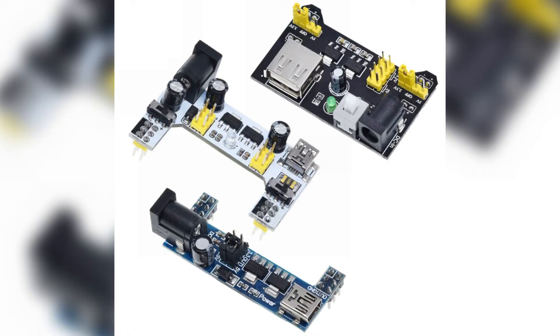Choosing between these three units really depends on the size, what you're going to use it for — they've all got the same 5V and 3.3V. Sizing is one factor, and whether you're going to be switching voltages regularly is another. You may want the white one if you're switching between 5V and 3.3V frequently. Just remember whenever you change it — if you've got a 3.3V chip or module plugged in, you don't want to suddenly put 5 volts into it as it could damage the chip. The jumpers can be a bit safer if you're not sure about voltage changes.